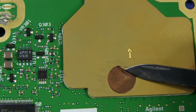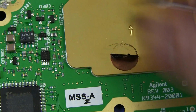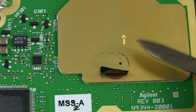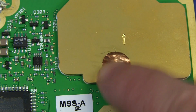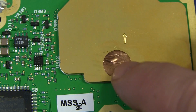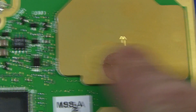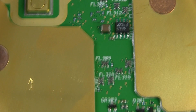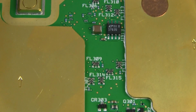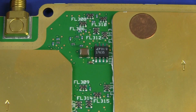What's under that? Is that an access port? Because that looks like copper tape. No, what is it? Whoa, we got ourselves a little hole under there. Little access hole. Wonder what's going on there. But that, yeah, is sealed with copper tape there. So, shield that, you know, we're talking about 20 gig here. Put a bit of spit back on that. She'll be right, no worries. But yeah, little access hole under each one of those. Got those lovely board-to-board RF interconnects again. Another LT part up there, but obviously not a critical part of anything outside of these shielded cans, of course. Nothing to do with the RF part of it.